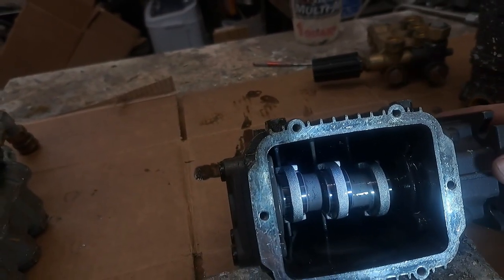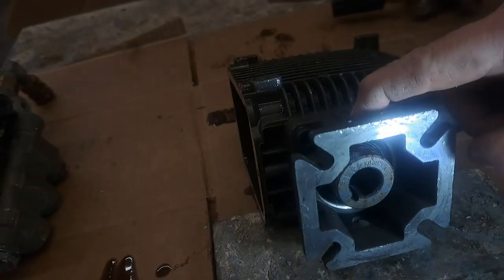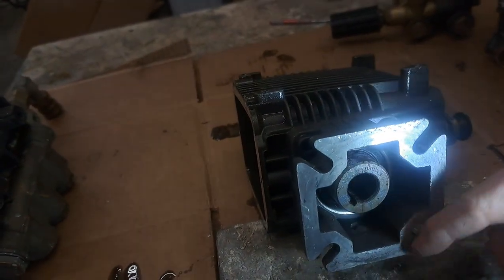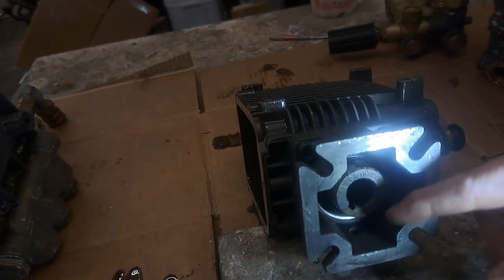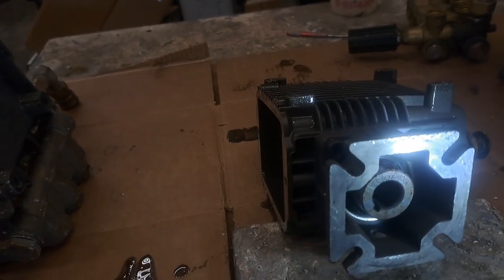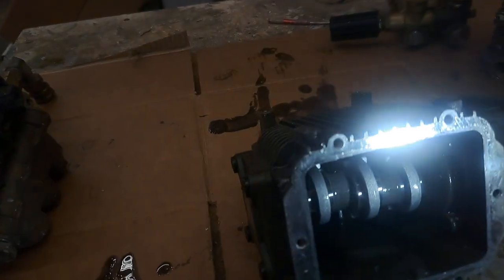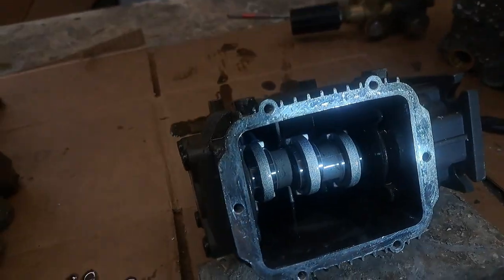Notice this section where the pump connects to the engine — there's nothing in here. These holes allow you to access the keyway with your Allen wrench, but no fluids should be here. If you have oil or water leaking from here when it's connected to the engine, you've got problems. There's a seal here that holds the oil in. Water coming out means a major problem — a leak at the front and at the side. If it's just oil, you can replace the seal and bearings and you're good to go.